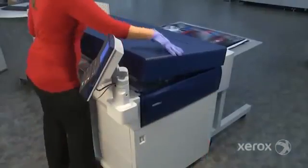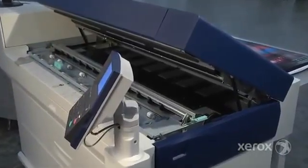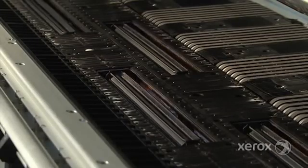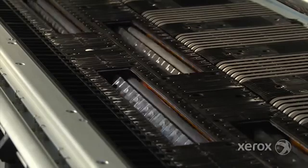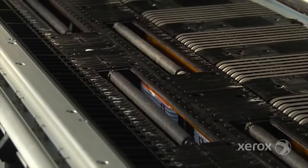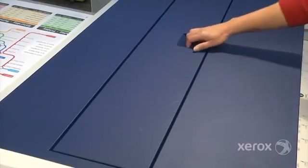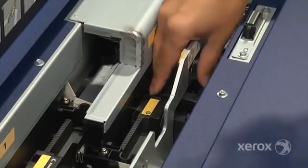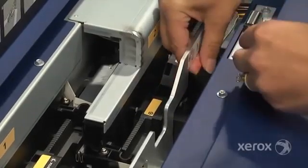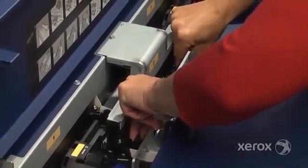To manage and minimize missing jets, the system conducts an automated cleaning process that takes just over a minute. During the cleaning cycle, a set of rollers are engaged that wipe the print heads as ink is pushed through. The cleaning process runs a cycle when the printer has been idle and every 15 prints or 30 meters, whichever comes first. Print heads are a customer-replaceable item accessible via the top panel. They are very quick to change as they essentially pop right out. Once the new head is in place, the system primes and calibrates, taking about 10 minutes in total.